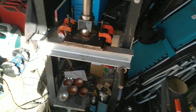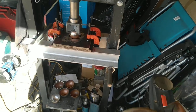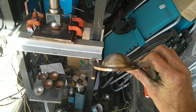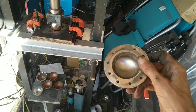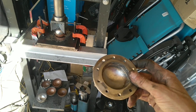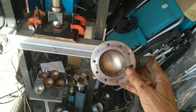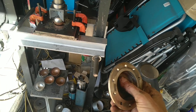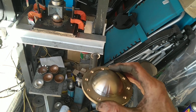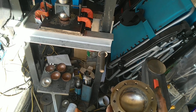I've made many of these in the past and the last one I did was this one here, and when my friend welded it for me he sort of blew through the inside. This was 0.9mm stainless 316, but this time around I'm actually using 1.5mm, so hopefully that'll help him out so we don't burn through.